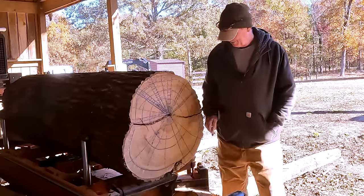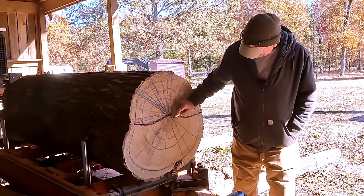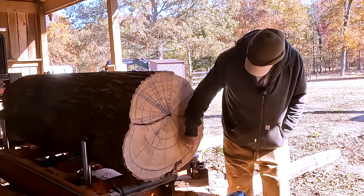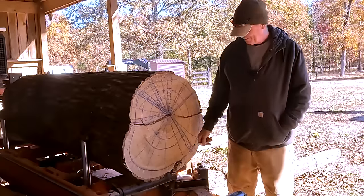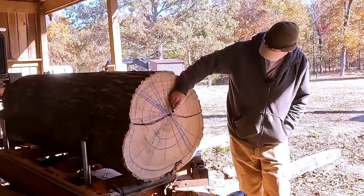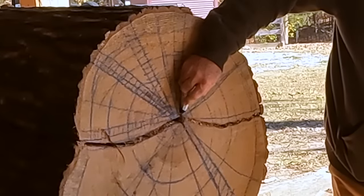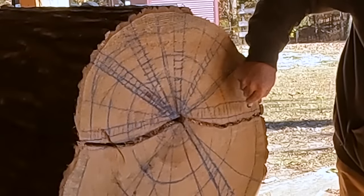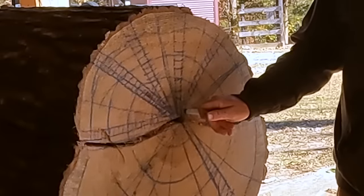As I'm going to take a board, whatever technique I use, I want my board to be as parallel to the crack as possible, which puts it perpendicular to the growth rings. There's a crack — just make a straight line. There's my growth rings. That'll be a quarter-sawn board and it will show ray fleck, as long as I've done those two steps.